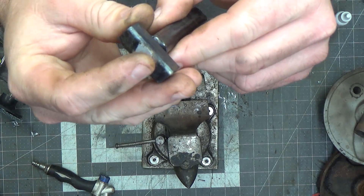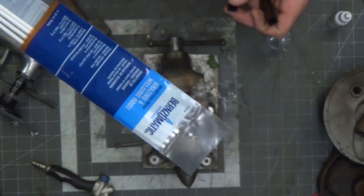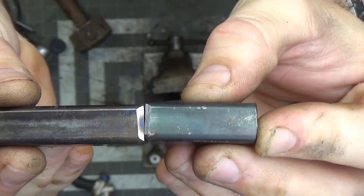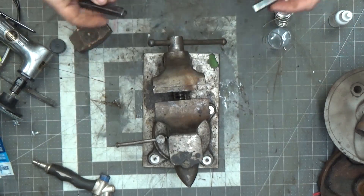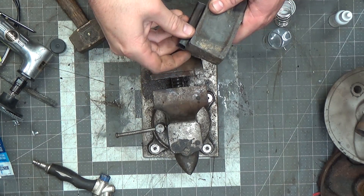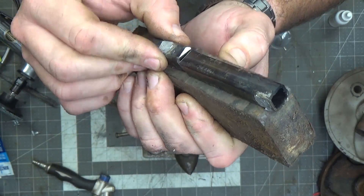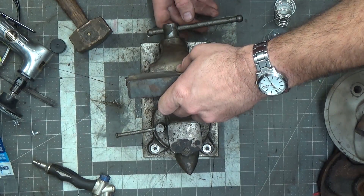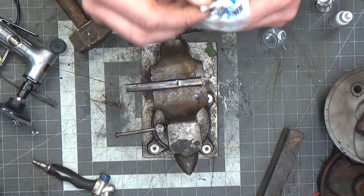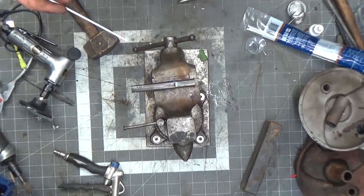Let me try something a little different. I'm going to clean up this side and try to braze this on here with the brazing rods. To be honest, I don't think I've ever brazed in my whole life, so we'll see how that works out. I'm going to try to just butt these together — I've beveled the joints, they're not going to be completely straight, but we'll see if we can make it work. I think this is brass with a flux coat on it. From what I watched last night, I think I'm supposed to get this red hot and then start getting in there.